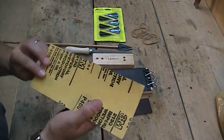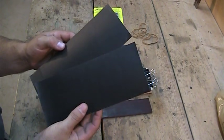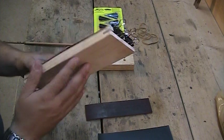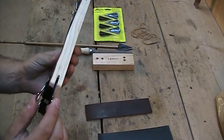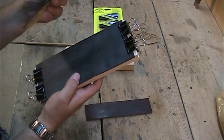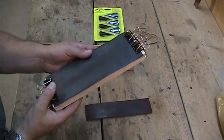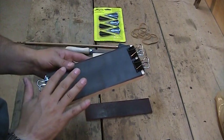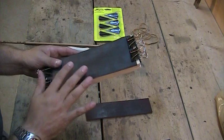This here is automotive sandpaper you get from Walmart. I like the 400-grit sandpaper — it comes in a pack of five or six for two bucks. I've made my own little block out of a piece of wood, sanded it down, cut a couple of notches to fit clips on each end sized for the sandpaper sheets. This system is just like a whetstone but lets you control the grit, and it works absolutely phenomenal. I've been sharpening all my knives and broadheads using sandpaper for many years, and the system is impossible to beat.